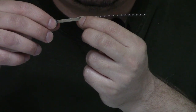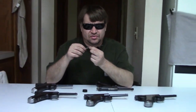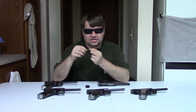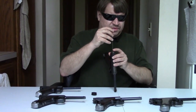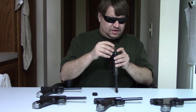One change first introduced by Kokura was the flat-sided striker guide, introduced around 1934–1935 and made standard at Kokubunji shortly after. The length and firing pin remained the same. The reason for this change: with those two cylindrical pieces — one fitting inside the other — in cold conditions they could freeze together, or if left cocked with rust or stuck grease, they could bind, delaying the firing pin strike or causing light primer strikes. By reducing metal contact, they improved reliability.